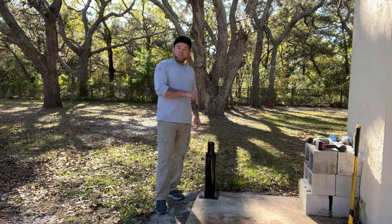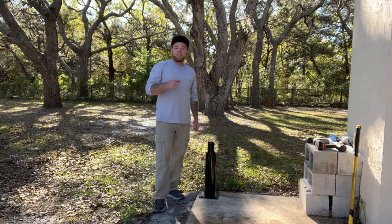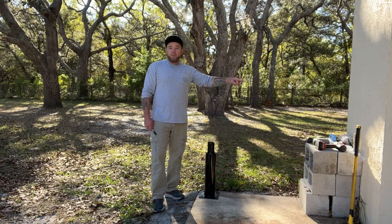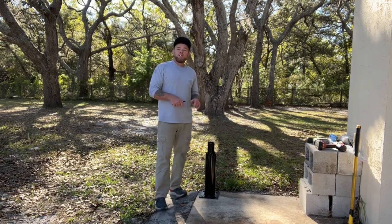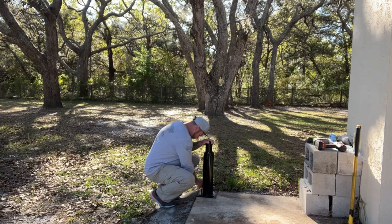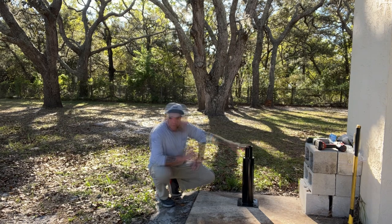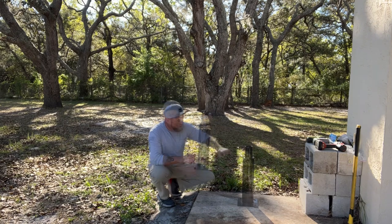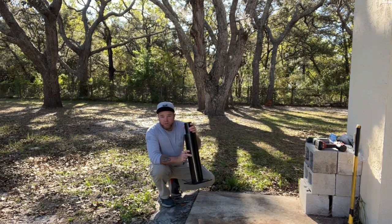This light is not going anywhere — this is going to be more than sufficient to hold it for the rest of my life. You're certainly able to use the provided hardware. When you drill your hole you'll need a hammer to hammer the sleeve bolts down, then put your base down and tighten the provided nut with a lock washer and regular washer. I'm going to use those washers for my three-eighths tapcon anchors as well. Once you have those holes marked, have your concrete masonry bits ready to go. I highly suggest using a hammer drill for concrete. If mounting on a deck or wood, you can through-bolt it or use lag bolts.